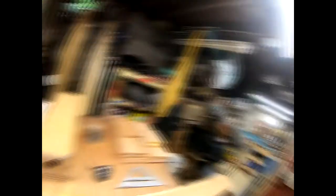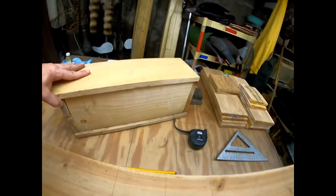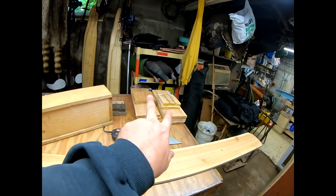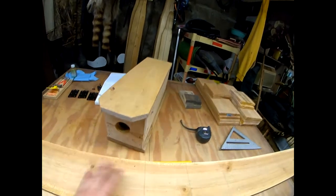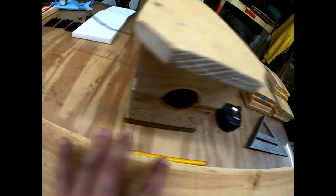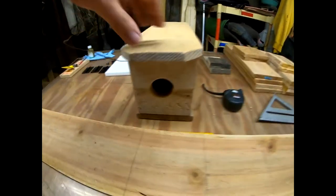Here's my weasel box — pretty basic, simple box. We're going to go over all the dimensions and I'm actually building three more. The design has a full bottom, my sides are tucked in a little bit so my box isn't the full width of the cedar plank, and then I just have a hinge on the back. You can see how my front is cut in half.